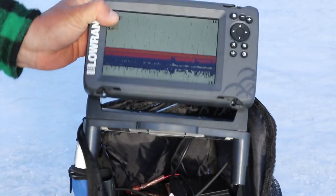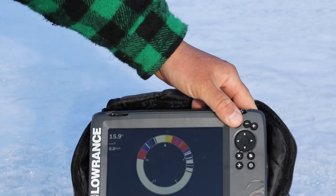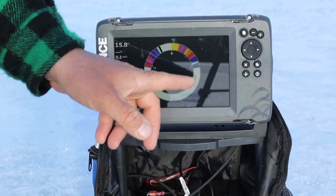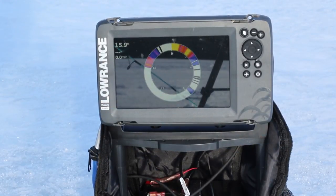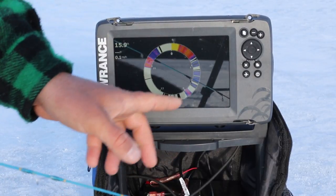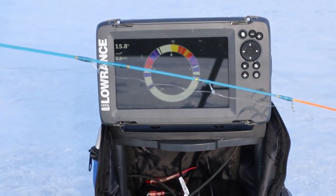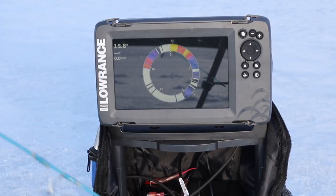In a nutshell, that's how you use it. We're going to show you guys some fish catches and what a fish looks like. As for other screens, you can get into a full flasher mode by just hitting your pages button. This gives you a flasher just like your typical older flasher. That's actually the jig right there — that purple — and with the sensitivity pretty high you're actually seeing the line too. All of this white is the water column and this orange is the bottom down there around 16 foot. You can see I'm dropping the jig down — there it is around 13, 14, 15, 16 — and it's right there on the bottom. That's how the flasher works, and that's another page you could use.